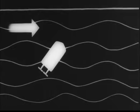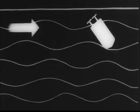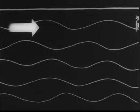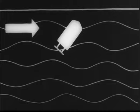In the diagram, the tank is approaching at an angle with the stream. The left-hand track touches the bank first. As its traction is greater than the push of the propellers, it will simply steer the DD round and back into the water. To counteract this, then, immediately the track grounds, the propellers must be turned to assist the stream to swing the tail round so that the outer track may also grip the bank.